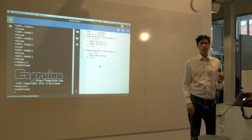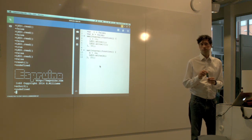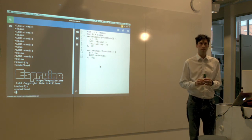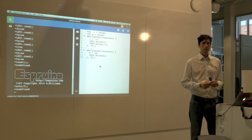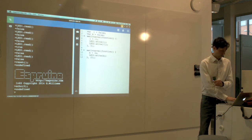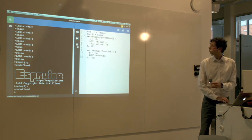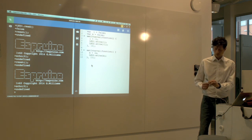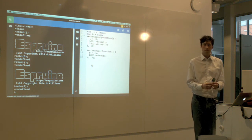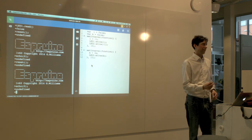These are still slow enough to perceive. I think normally you say that the eye can perceive 60 FPS, and that's around 17 milliseconds, 16.666 or something like that. So as soon as you go below that, then in theory, let's see, 10? 15. They look solid now, but they are actually blinking. Yeah, you see it?